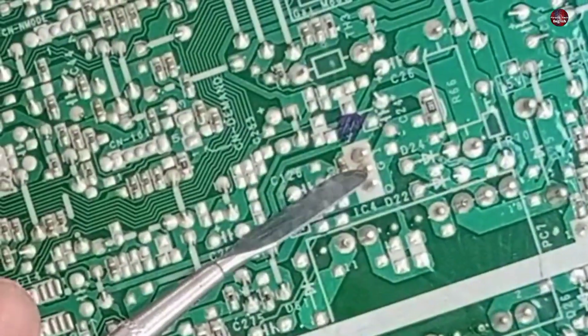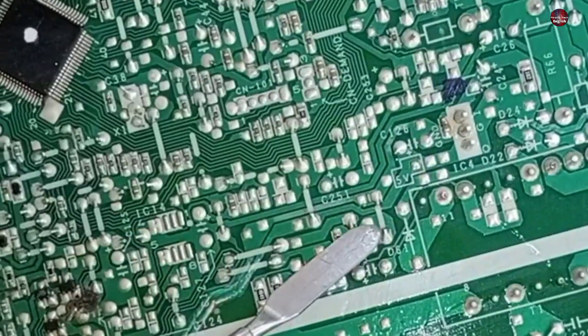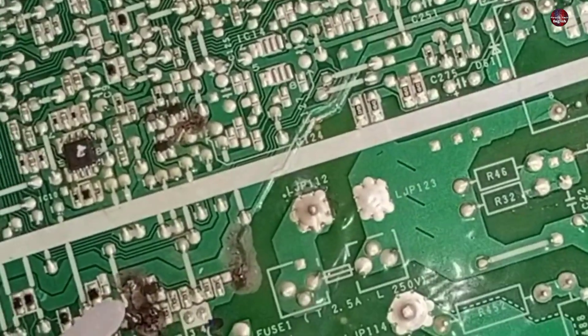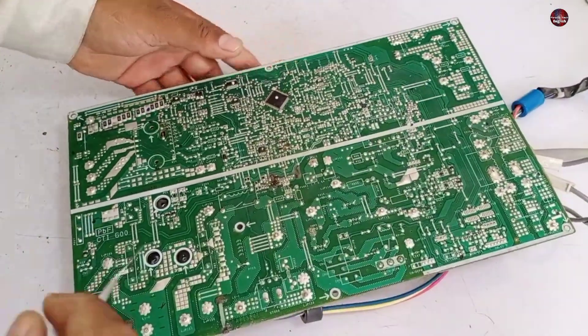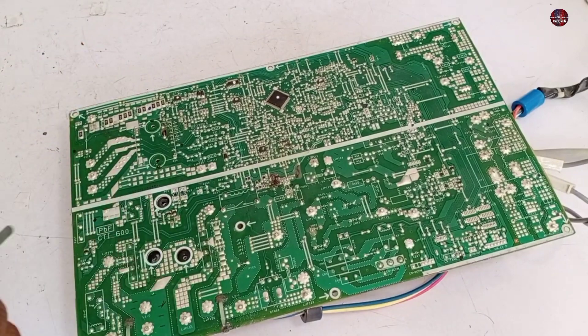This is a 5 volt voltage regulator. When I follow its prints, all the ground points in this area of the motherboard have gone bad, which means the positive line was passing through these prints. These wrong wiring connections make this condition with the motherboard, and even the microcontrollers go bad. Then such motherboards are not possible to be fixed.